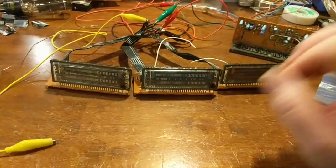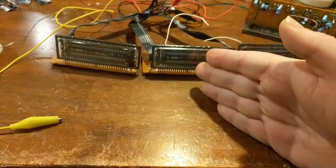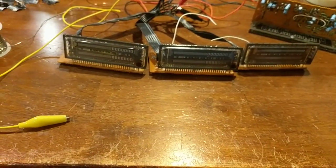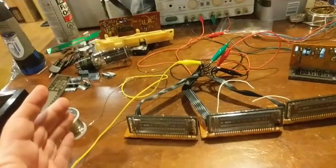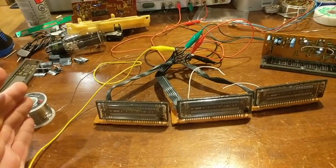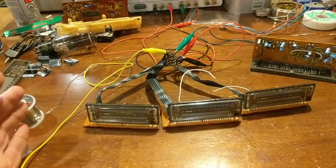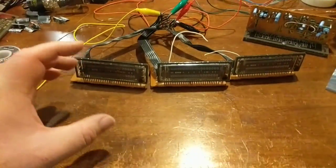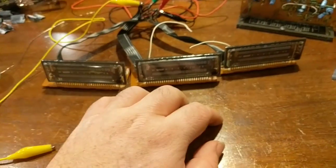The downside is that it complicates the power supply, because I need a positive and negative rail to run the op amps. I want to do a split rail because I want to work around 0 volts. I don't want an offset. So that's that. Also, since the amplifier requires 24 volts, I need a 24 volt power supply, but then I've got a 24 volt to 5 volt DC step down, which will run the Raspberry Pi.